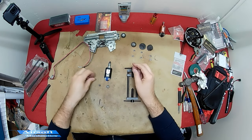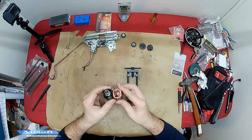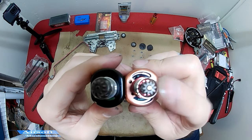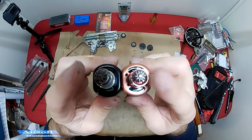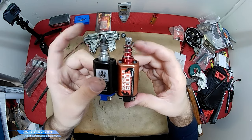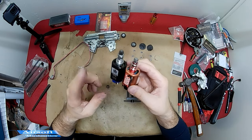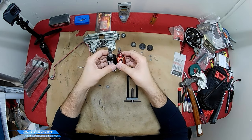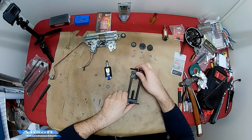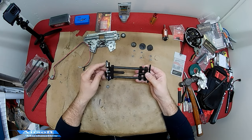One thing to know — and I should take a picture of this as well — on the motor there are two different style pinion gears: there is a D-style and an O-style, and each one has a different way of removing them. The O-style has no set screw unlike the D-style, where you just unscrew it a little bit and pop it off. The O-style, like the Krytac, is pushed on. To get that off you need a little jig — a puller — I forget the exact name but I'll post it down in the description.